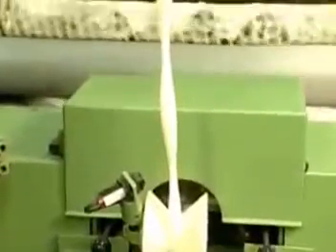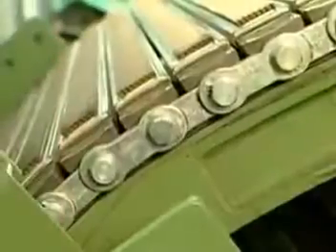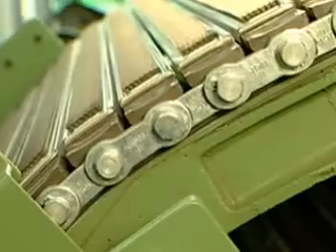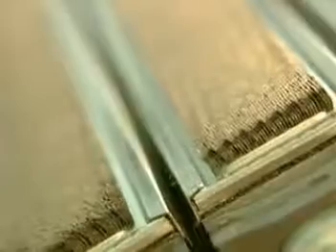The card is made up of a series of cylinders which are wire wound. This wire has tiny teeth cut into it, and each tooth serves to transport a small number of fibers through the machine. There are also wire-covered surfaces called flats that come in close proximity to the main cylinder. This is the area where most of the carding action takes place.